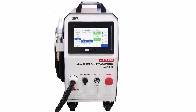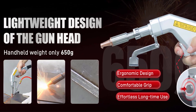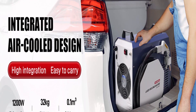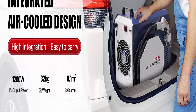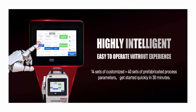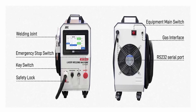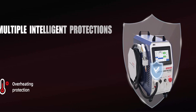Wide range of welding possibilities: carbon steel butt welding, fillet welding, spot welding, 2mm fillet welding, 4mm square tube butt welding. Suitable for welding a wide range of metal materials with flexibility and adjustability — particularly suitable for high quality welding with easy preheating of different materials. Widely used in hardware, building materials, kitchenware, aerospace, automobile, and other industries. Multiple intelligent protections: overheating protection to prevent damage from exceeding safe operating temperature; optical cable connection interlock safety circuit ensures the handheld welding head only emits laser when the nozzle is connected and in contact with the workpiece.